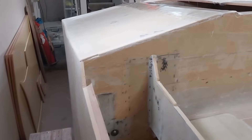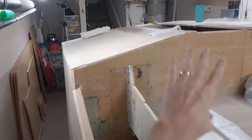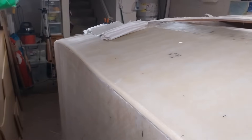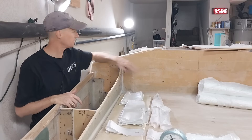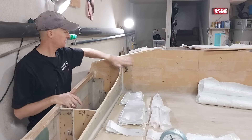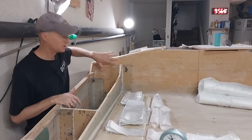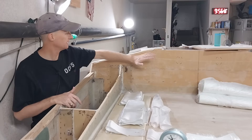Next I've got to do the outboard side, and back here frame C5 onto that deck panel. You can see on top here I even wrapped over the edge a good inch. I've got all my fiberglass set up for part two where I'm going to get the aft end of C5 onto the deck, and then the whole seam up to frame C2 at the bow. Up until now the back side of frame C5 only has six-ounce cloth on it, so in doing this seam of the deck onto C5 I'm also going to come all the way down to the aft deck to add more reinforcement — two layers of 10-ounce cloth and a layer of six-ounce cloth.